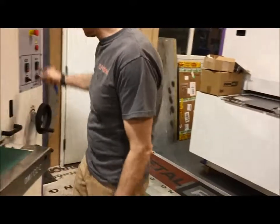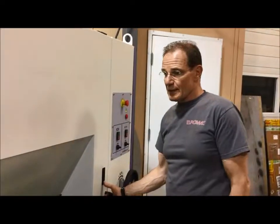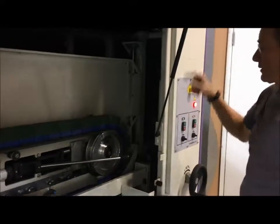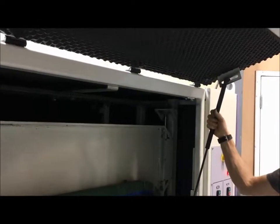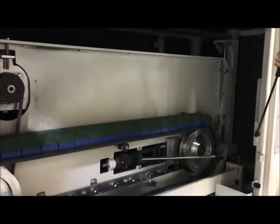When you activate the safety flap, your e-stop light comes on. There are only 6 e-stop conditions. Actually 5 on the new machine. The first e-stop condition, of course, is hitting the e-stop button. You have one in the front and one in the back. That's number 1 and 2. The second one is that your safety switches, which are magnetic on this machine, for the doors aren't closed, which is number 3. And then on the back door, number 4.